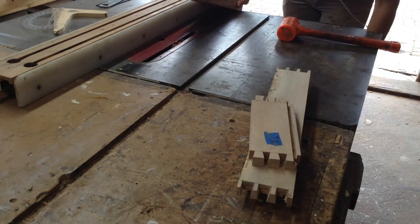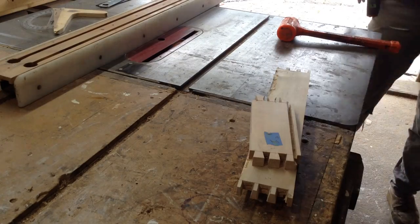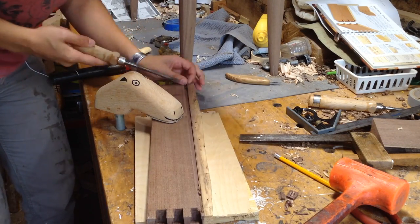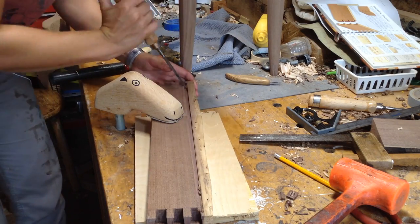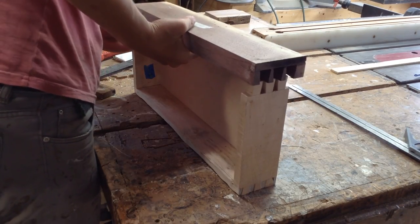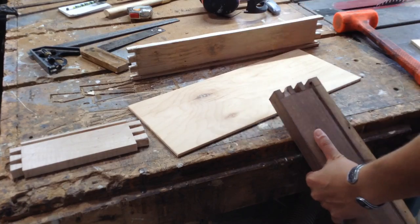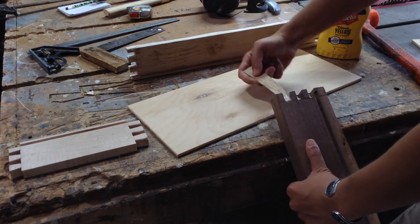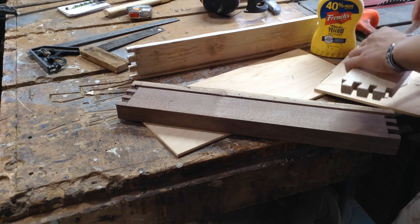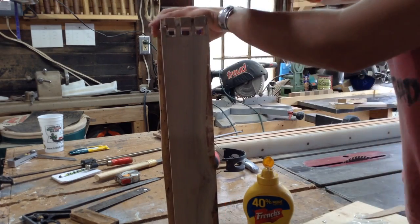Since it's live edge, it doesn't come fully down to the bottom, so it was easiest to cut it into the three backers and then mark it. I didn't want to cut into the joints on the side, so I'm lowering it onto my dado stack, then lifting it up and cutting that groove. Since that groove is going to be arched on the edge because of the table saw blade, I could clean it up with a chisel to have the exact same groove without ruining the front joint. After cutting the backer and adding the depth of the groove, I could glue it all into place. The plus side of dovetails — besides looking nice — is that the way the pins set in the tails makes it very hard to pull the drawer apart, and all that extra gluing surface area makes it substantially stronger.